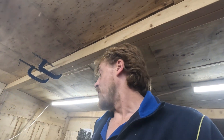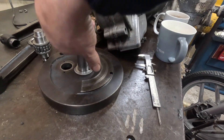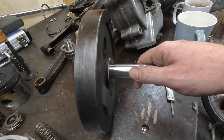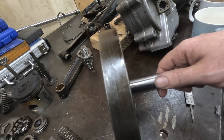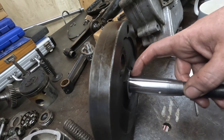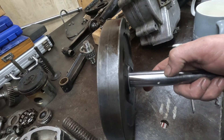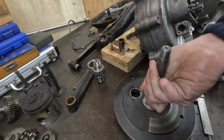Let's ignore that for a moment, because I don't know what I'm going to do. Well, who knows. We'll save it, I'm sure, one way or another. Right, let's move on. So we have this side of the crank ground. That went absolutely lovely. I did like most people suggested in the comments — I took the bulk of it off with something a bit more aggressive, and then smoothed everything out. Over that length from the cheek of the crank, it's within three microns. Which is as accurately as I can measure with my stuff, so I thought there's no point in trying to go any further.